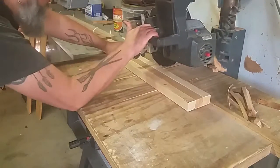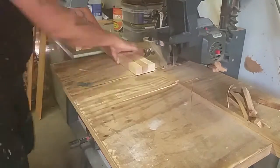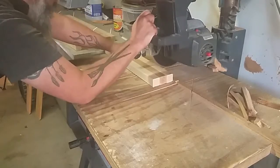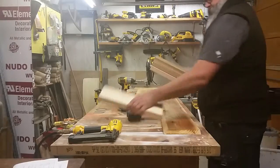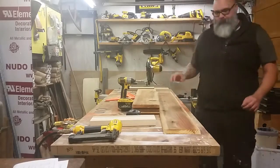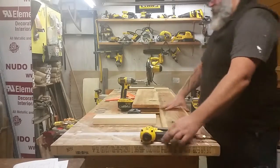You don't want to use pressure treated when doing a planter box, especially if you're using it for a garden. You don't want any of the chemicals that are used in pressure treated wood to go into your dirt, or anything that you're going to consume. It just could be bad. So cedar is number one choice.